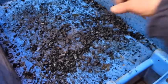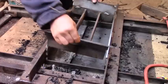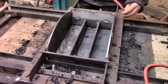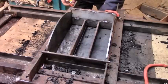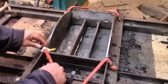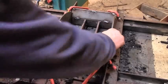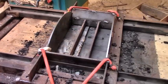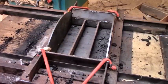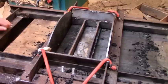Right then, so far so good — but can we speed it up a little, or ideally a lot? Again, easily done. I just made up this grid that drops into the main frame. I did find that it would rise up without the bungee straps on it, but when they are on it seems to work fine. Basically that grid has added two more end plates for the charcoal to get trapped against, so now one stroke of the blade should cut three times — once, twice, three times.